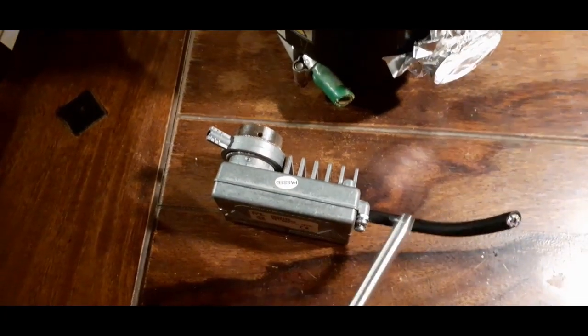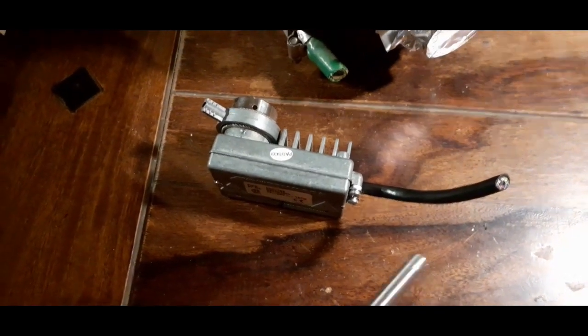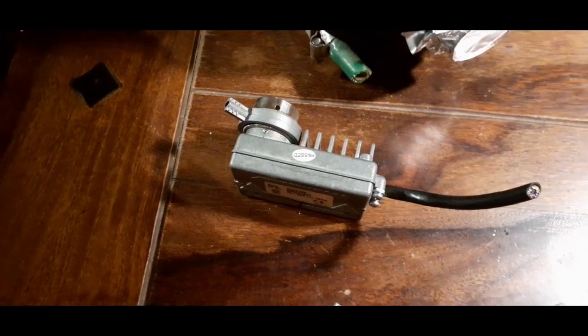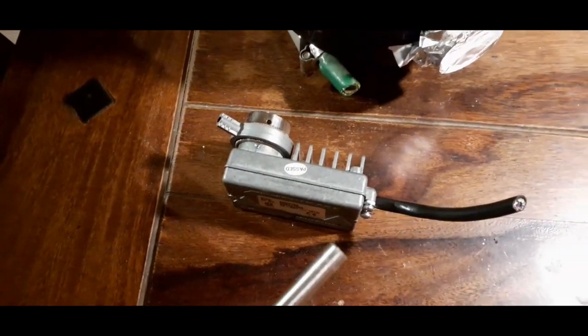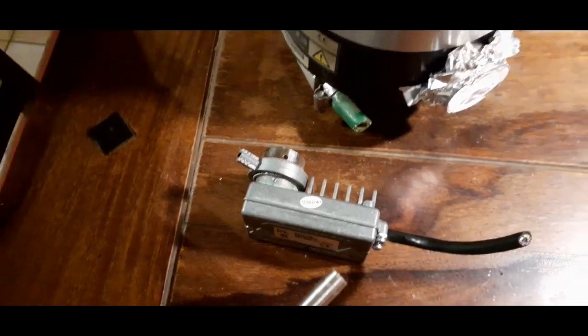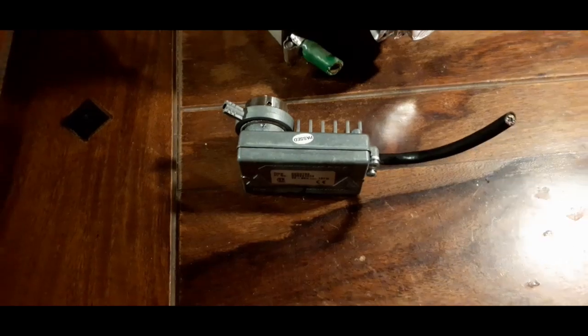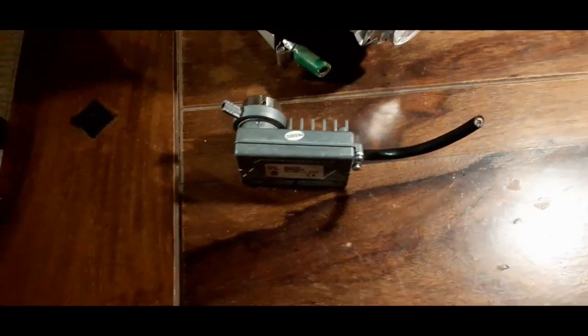It's pretty simple to interface. It just needs some voltage and then basically just needs a button to turn on and off the pump, and that's it. It also has an analog output of motor speed, so you can display or monitor the pump speed. A pump that's running nicely should run around 80 to 100% speed. So that's like a really useful little module. Unfortunately, this one needs an 80 volt DC power supply, which is going to be a challenge.